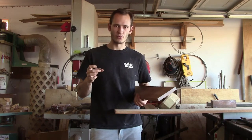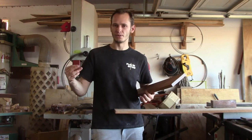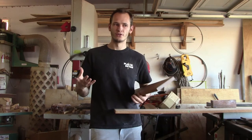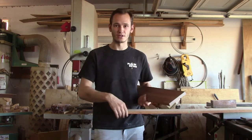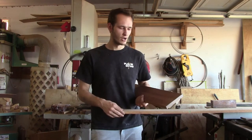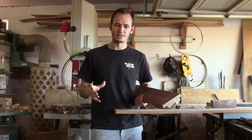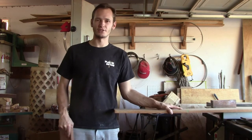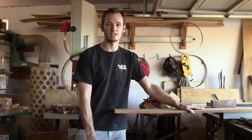It's the circumference. So when you turn a piece of quarter sawn leopard wood and a piece of flat sawn leopard wood into two blanks, they're not any different because the four faces just become one and they all blend into each other. So a specific cut on a piece of lumber that you're going to turn into a pen blank — quarter sawn, flat sawn, rift sawn — doesn't matter, because in the end it's just going to have one face. That means this piece of low figured leopard wood will produce blanks that have just as much figure as the high figured piece.